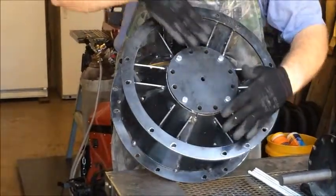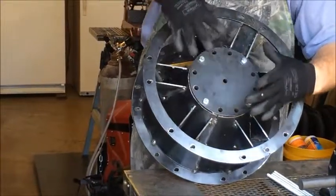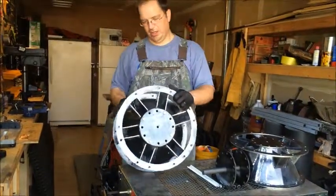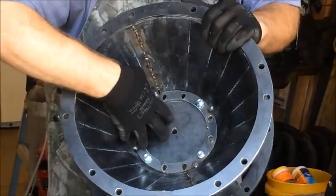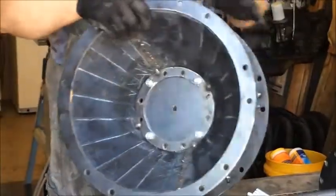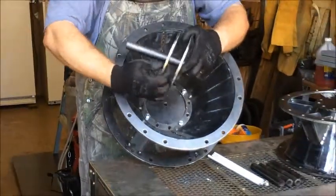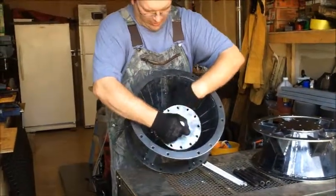The arms aren't nice and symmetrical. There's six arms, 60 degrees each arm. But the cone itself isn't nice and round — it isn't a nice symmetrical round shape. So the arms weren't able to be put on in a nice symmetrical pattern. The inside looks like this. You can see there's an inner ring here welded inside this cone, and this is the central attach point. The outer face plate is here. The actual drive axle itself will be two discs with matching holes already in them, welded onto a piece of round bar.